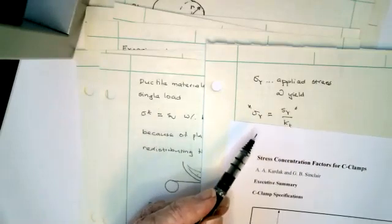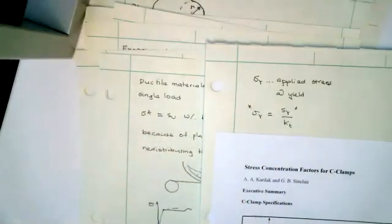So the discussion in the book, the one for brittle materials: unless you know that the size of your stress concentrator is so small that it merges in with the local stress concentrators and you can get size effects, that would be like the piece of paper with a pinhole in it, you don't see it. If you don't know that, then you want to use KT to reduce your fracture load, and then you're going to reduce your design loads in the same way. And if yielding is a problem, you better use KT there too.